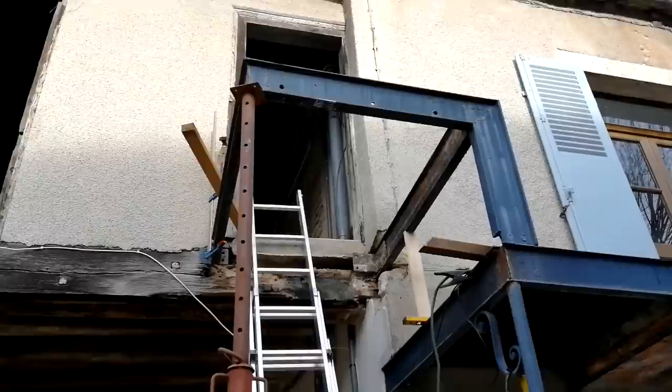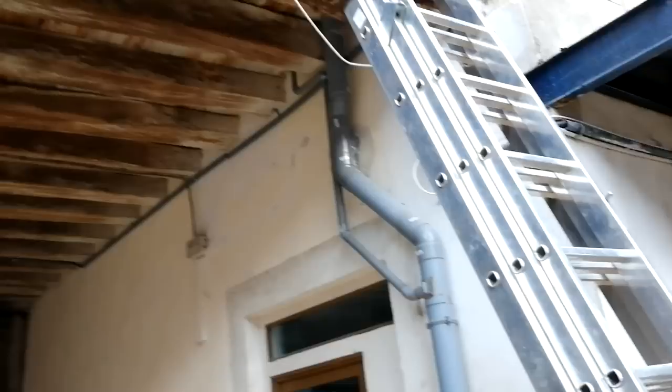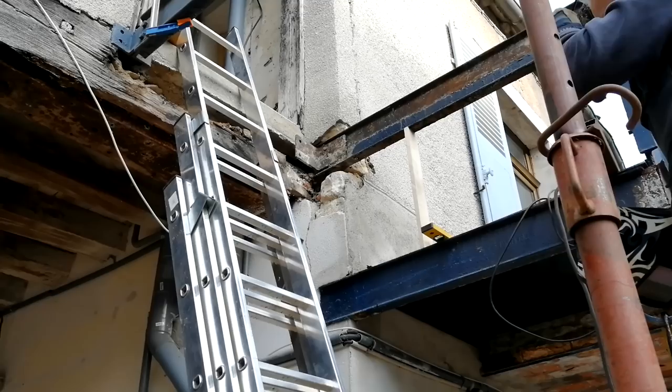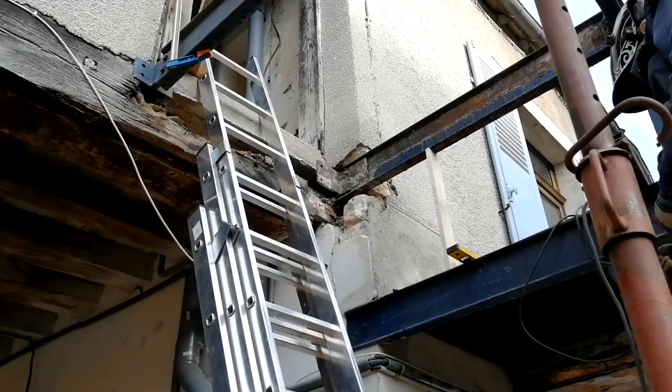And you've straightened out these steels, haven't you? You've moved these steels, haven't you? Yeah, they're all level. Okay, so he's levelled up the steels. Are they tipping away from the building slightly? This way, yeah. Then you're going to make a wooden box around that steel over there and fill that up with concrete? Yes, to make a pad stone.